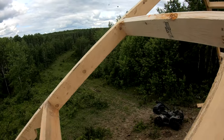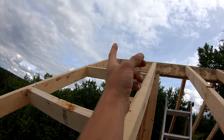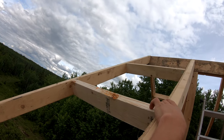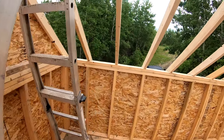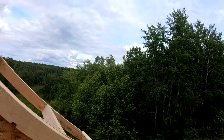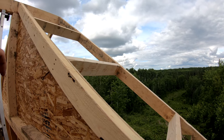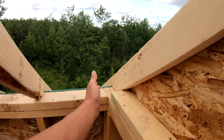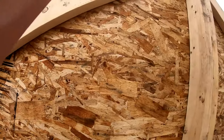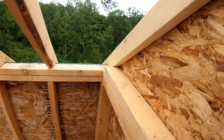Finally got all these ones done. I'm dangling off the ridge beam putting these damn things on — just dangerous as fuck. And it tires you out too — I'm running low energy with all this dangling off the edge and climbing up the thing like a jungle gym. What we're going to do now is put in this next rafter right here. And then from there we can build our frame here for the windows and whatever else. This section is three and a half inches wide and these are only an inch and a half wide, so if you put them right beside each other you'd only have three inches — a little fucked. If you give yourself half an inch here and then line the outside edge of the rafter right up with that wall, you'll be mint.